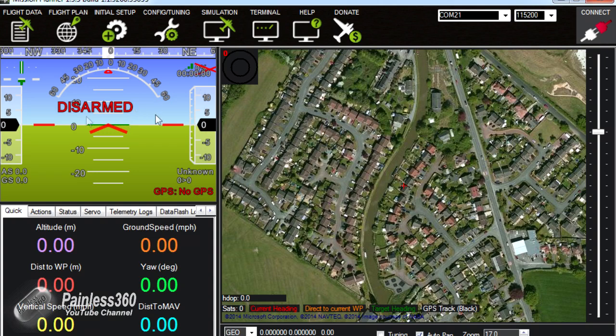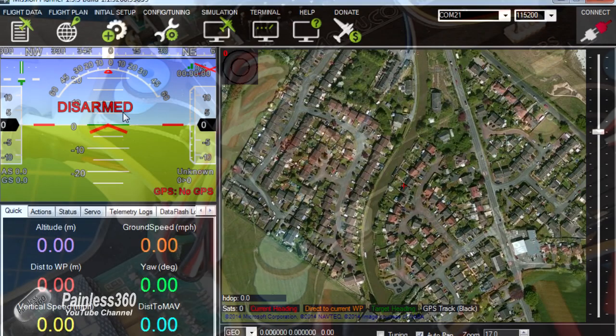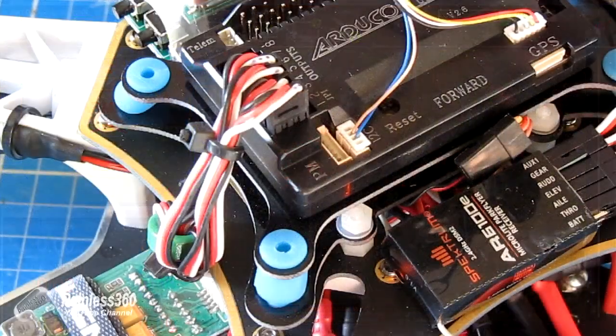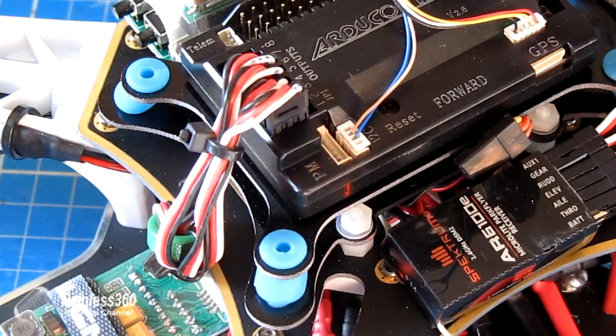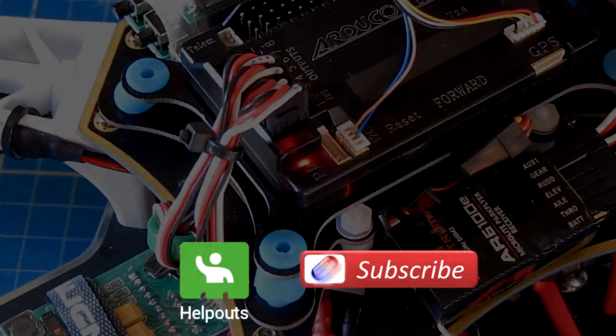Hopefully that's useful for those who are looking at APM, or if you've done an upgrade or changed something and now the board won't arm. Make sure that your end points on the throttle and right rudder are far enough along so that the APM sees the low values. Make sure you're not in loiter mode waiting for a GPS lock, and if all else fails, plug it into Mission Planner via USB and MAVLink and see what error appears in the artificial horizon. Thank you for watching — please like, subscribe, and comment. My help-out channel is available if needed, and my next APM video should be out in the next four or five days. Happy flying!